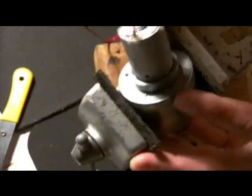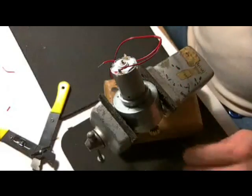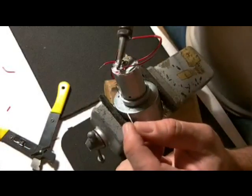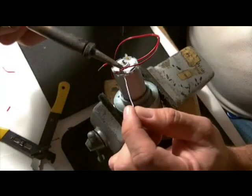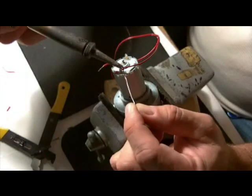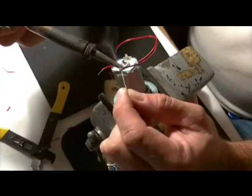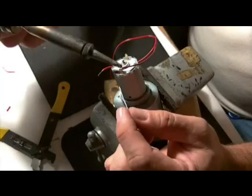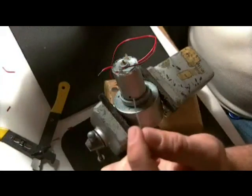So you've got your wire through the connector. Now what you want to do is apply your solder. What you do is you want to heat your post first. Put your flat part of the soldering iron on the post, apply your solder — apply a good amount here. And then let go of both at the same time. So you apply your soldering iron, apply your solder, and then release both of them at the same time.